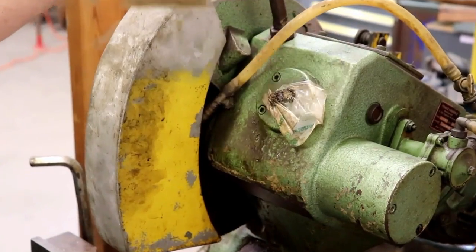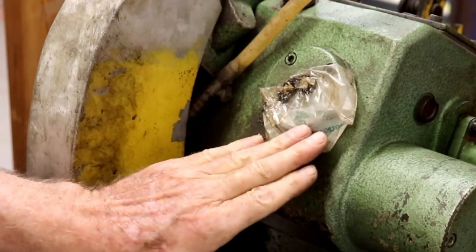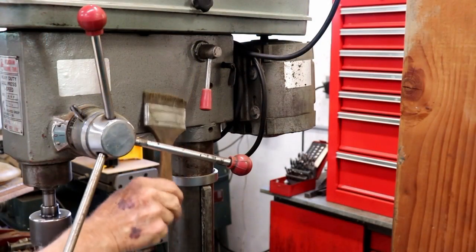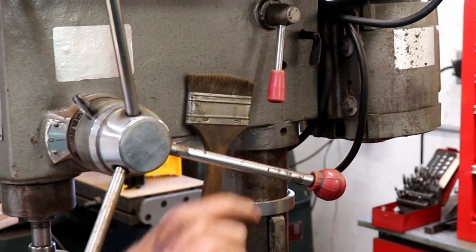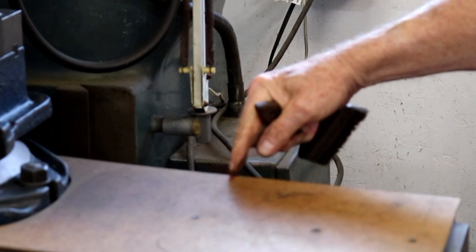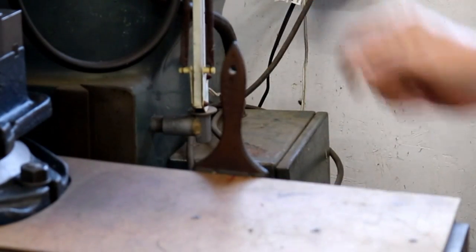On my cut-off saw, as you saw in one of my other videos, I have a computer magnet right here on the head. I like to keep it in a plastic bag — it makes it much easier to remove the chips, so that brush just lives right there. On the side of my drill press, I keep the magnets right there; the brush stays right there. I don't like laying them down on a table or workbench, because you're always putting stuff on top of them — if you use a magnet like that, it's always going to be right where you put it. On my mill, I have a magnet stuck to the back of the table, and I put a little red mark on the top of the chip guard so I always know where it's at.